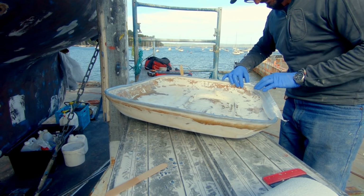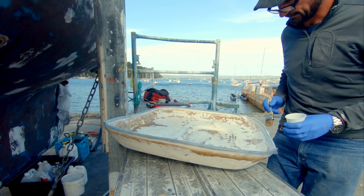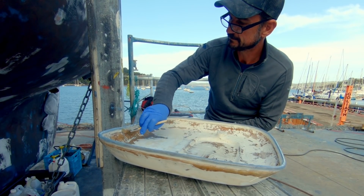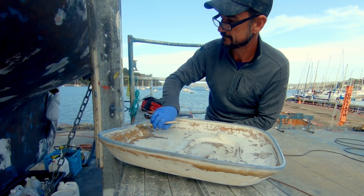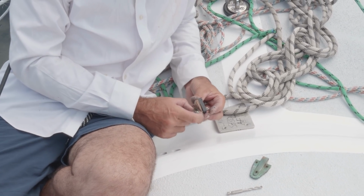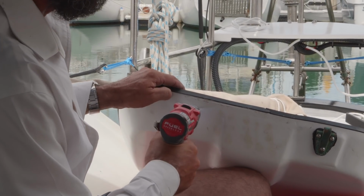Although slightly more expensive, using pre-cut fiberglass tape for these sorts of projects saves time and a lot of mess. We've also found that cut fabric is more difficult to keep in position when wetting out and consolidating. Fast forward to us back in the water, with the hatch faired, painted and with some new rubber seals. It was time to consider how we would install it back on board.